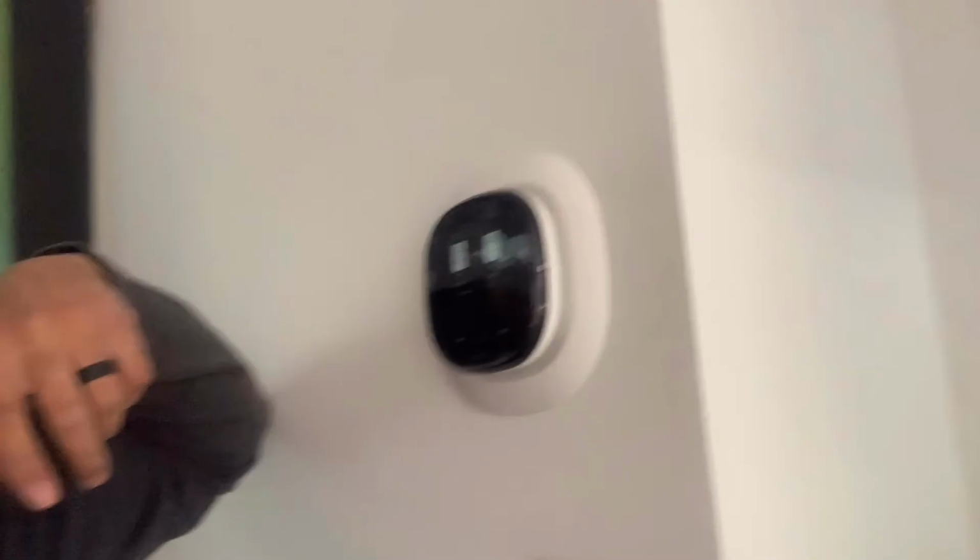All right, my people, I'm back. So what's going on is that, my comment on the board, this is such an old system, 1998. That's over 20 years old. It looks like it hasn't been maintained properly. It's giving us problems. So what I did was I had to look for 24 volts to give power to that common to be able to turn that thermostat back on.